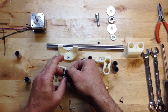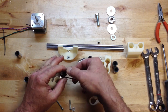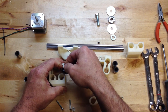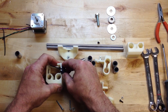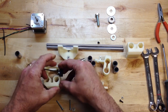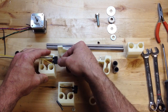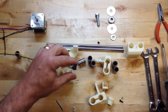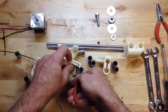Instead of resting on that bump, this will be right about there — it'll be down just a little bit, but you'll still be able to catch that end stop. There we go — you're going to move that end stop over right where it should go. Even though we don't have that little helper, really cinch it down good. This will still work for your end stop. The difference between the two is this is pretty solid, and this has some flex — but not bad — and they end up being mounted in the same place. So that is the X end stop.